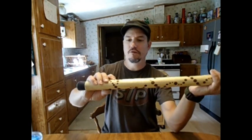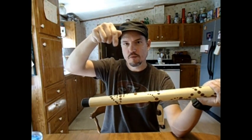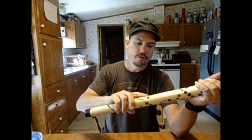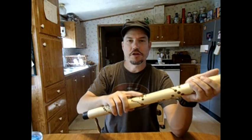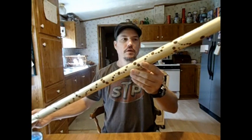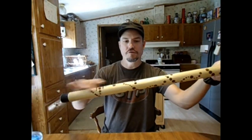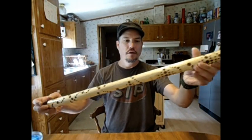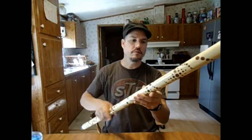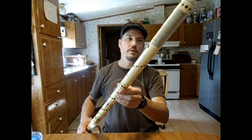The wood filler I had to use — from when I drilled the holes and got a little too close, the bit wasn't exactly straight, it wobbled a little bit and chipped it out — kind of changed color when I sprayed it. It's not very noticeable, but it's still there. It took some time, and the end grain is really hard, but a lot of sanding and it turned out alright. Looks pretty neat. I like how you can see the end grain of the different wood dowels — the different colors and stuff. But that's it.